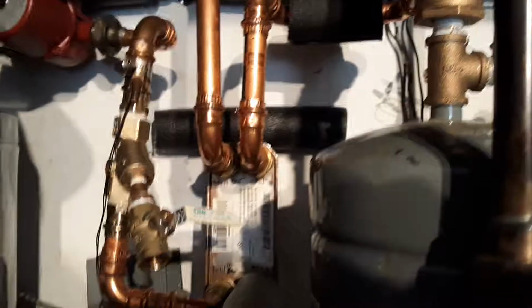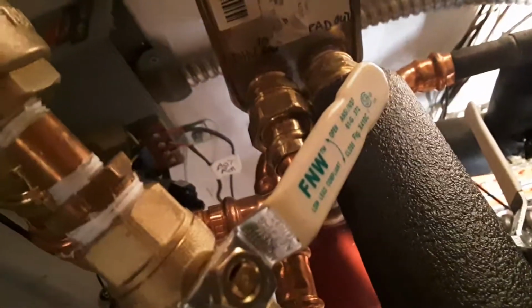So it circulates it through the heat exchanger and then of course pulls it off of the heat exchanger, DHW out, DHW in. That's good and hot, whoa. And then radiant in, nice and cool, radiant out. Comes here to our mixing valve. See what that says. I don't know if we can see that. It's only about 90. Only going out about 90 degrees, and that's not much to heat a floor.